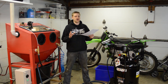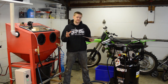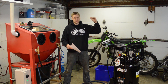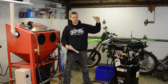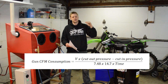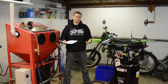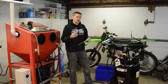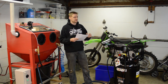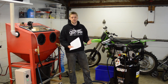I want to talk about how I determined what the guns consume. A few weeks back I did a pump CFM calculation when I installed the new pump on my compressor — I just did that process in reverse. For each gun, I started with a full tank at 175 PSI, started a stopwatch, and timed how long it took to bleed off from 175 to 140 PSI. I punched that into the formula and got the CFM consumption. I was trying to tune my gun for a 50–60% duty cycle, but then thought it'd be fun to see how low I could go so that guys who only want a 120-volt compressor can do this.